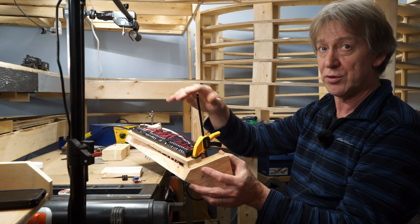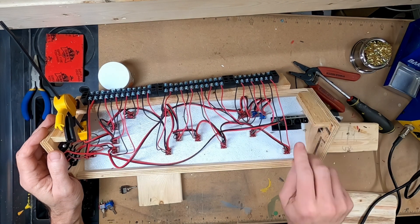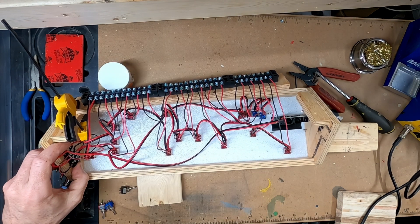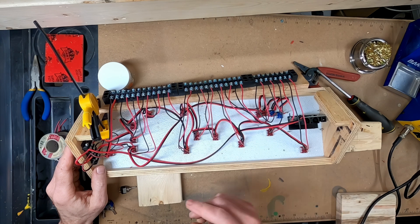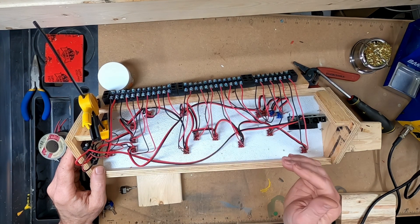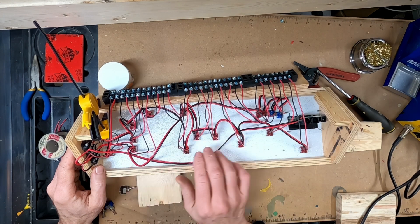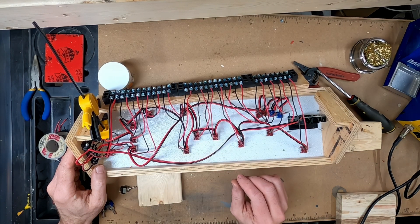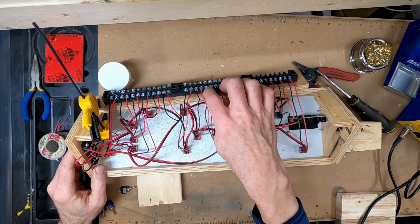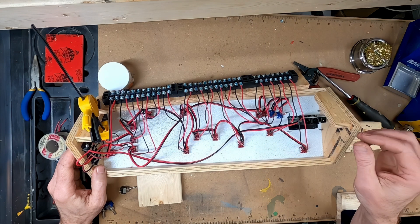The terminal strip will be my connections to the wires that actually go to the rails or to the tracks. The DCC connections are right here — these are the two main power outputs from it to power the track. I've run a set of wires over to this terminal block on this side, and from there I have run wires to one side of each double pole double throw switch. So the DCC system is providing power to one side — one pair of terminals — on each one of these switches. I've also soldered wires to the center terminals of each switch, and those wires go to a pair of screw terminals on this terminal block.